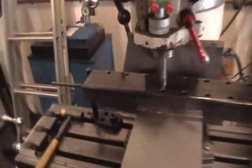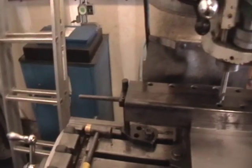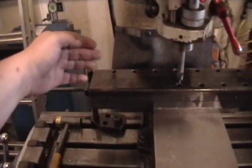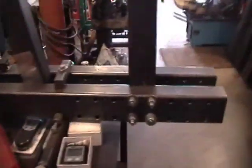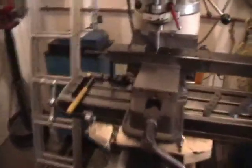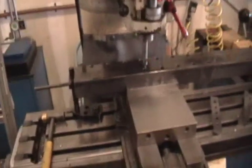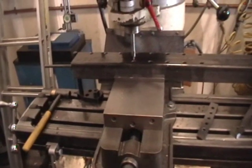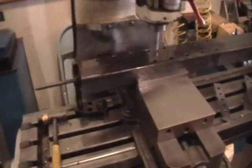As you can see here, I've already drilled some of the holes. On this particular jig they're two inches apart, both this way and this way. That way, whenever it's all finished, they can bolt up as you see here. As far as the drill itself goes, the best way to maintain quality is to make everything as rigid as possible where you want to avoid flex. That's especially important when you're doing any kind of drilling.